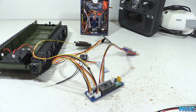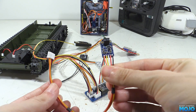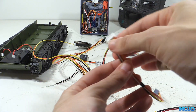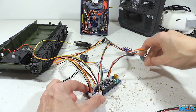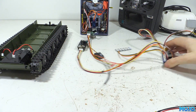Another off-the-shelf module — we have a two and a half watt class D amplifier for sound. It'll drive a 4 ohm speaker with an adequate sound level. It's not super loud, but good enough. I've used the same amplifier for a few projects and it does the job at a nice small size. There's no firmware to control it just yet, but it's otherwise ready.